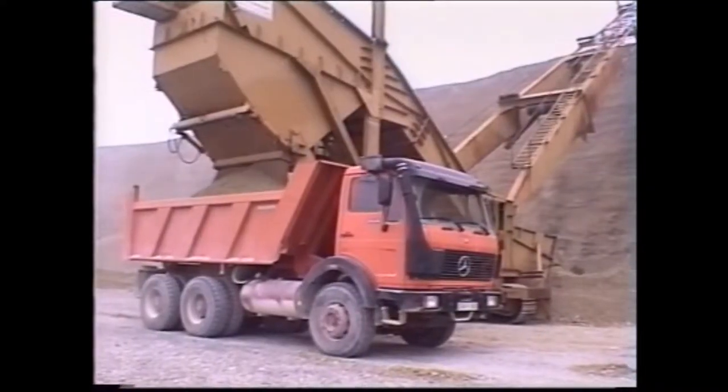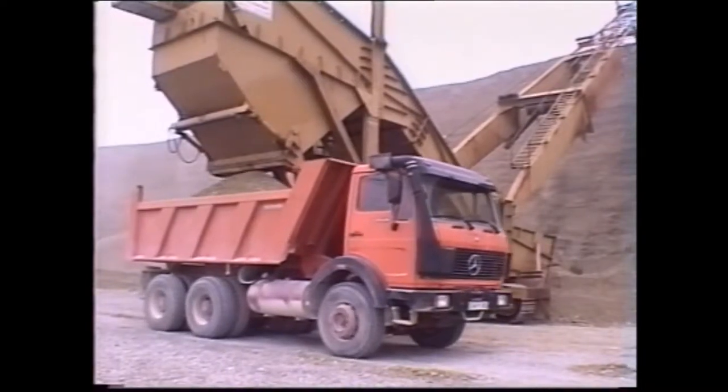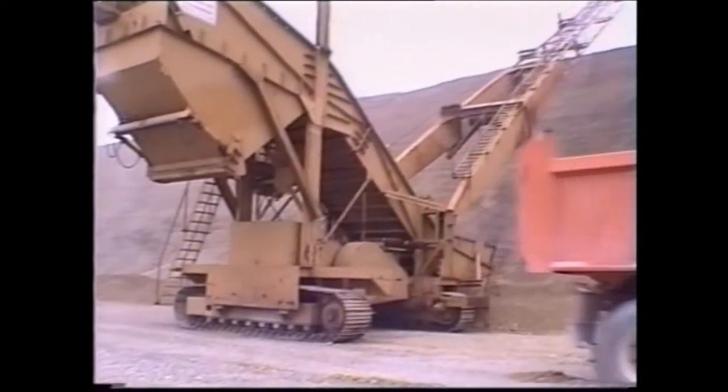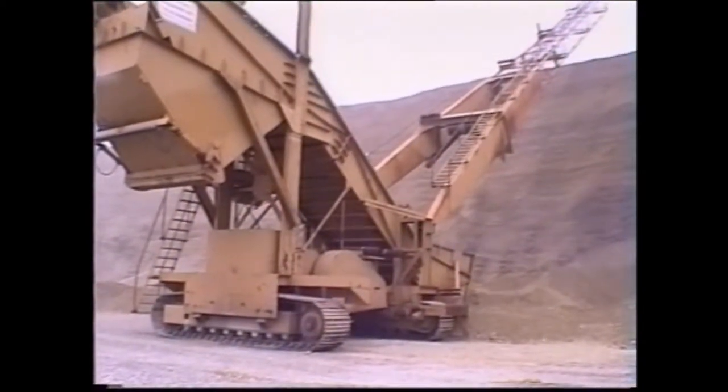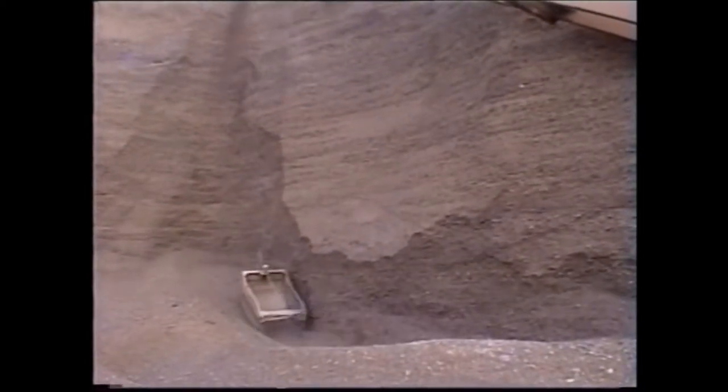This excavation site is a 20 meter high vertical working face. With a longer boom, up to 30 meters, deposits can be excavated in a single cut. The only component that moves within the collapsing zone of the face is the bucket. The scraper and boom are outside the hazard zone. The operating personnel and the plant itself are never endangered during the excavating operations.